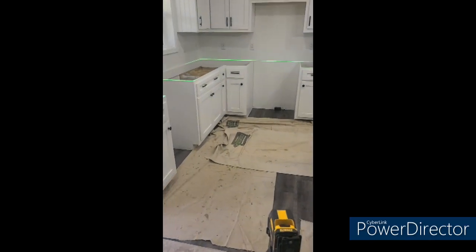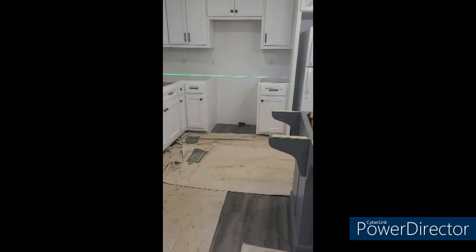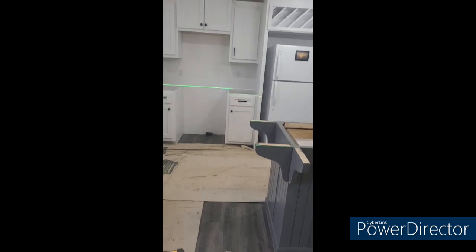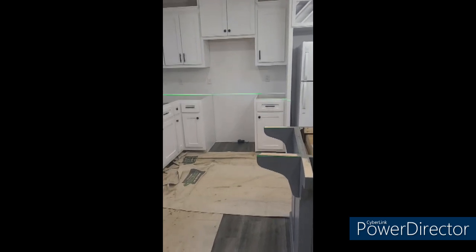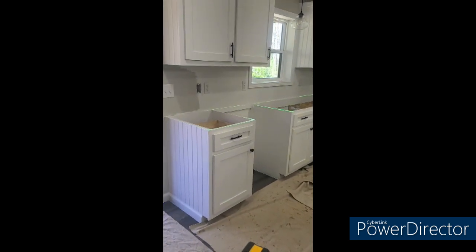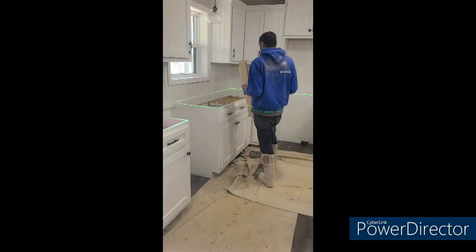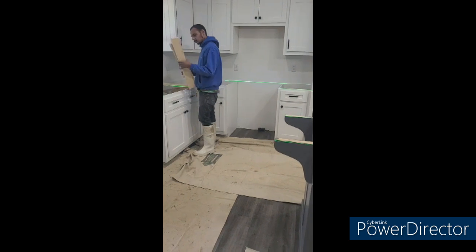In most of my videos you'll see me put my laser level up and show you what we're working with, then explain to the customer how the cabinets are off and we'll have to put some shims in — it ain't the end of the world. But this is kind of what you're looking for when you come into a house and put your laser level up. This laser is pretty much level all the way across the front of these cabinets. We don't have any seams on this job, but if we did it would make that seam go a lot faster and be a lot easier to level up. Everything would just be nice — so this is exactly what you're looking for.